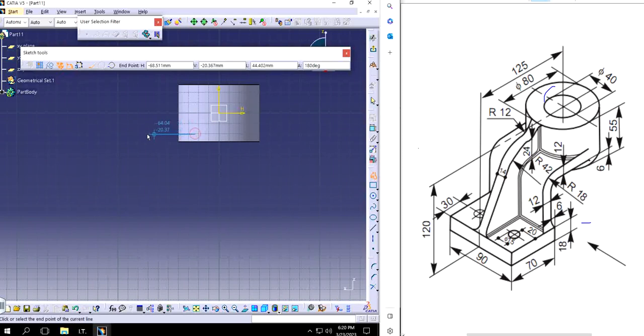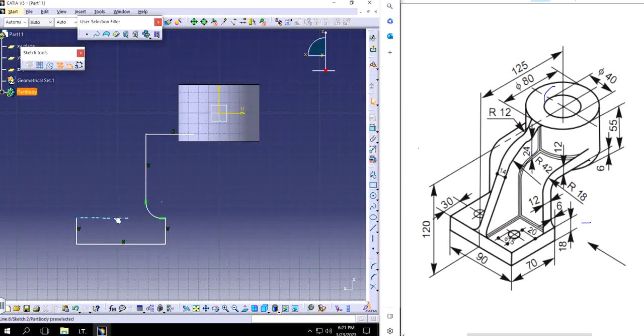So it goes something like something straight. I will add the fillet later on. Come all the way down, but I'm not going to stop here. Okay, then I have a small radius right here. Okay, no, not that big of a radius. Something like this that goes out and comes straight back. Add the thickness, comes straight again, go straight up. Yeah, right there. Come somewhere here, horizontal. Yeah, that looks fine. I'm just going to keep it here. All right, and I'm going to simply offset this.